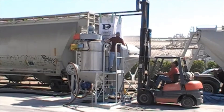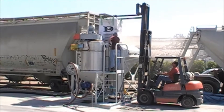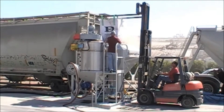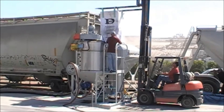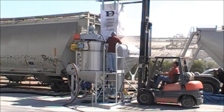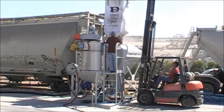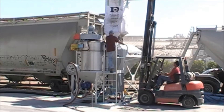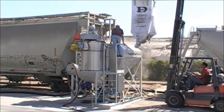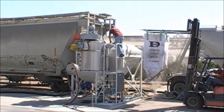The SuperSax TransPod includes a 150 cubic foot hopper with bag breaker and dust collection lines, a frame with fork pockets, 12-inch rotary airlock under the hopper, pneumatic transfer line, 3-inch air inlet with female cam lock, 4-inch outlet with male cam lock, a Wham pulsejet dust collector with fan, collection hopper with a 4-inch auger return to main hopper, cone vibrator, electrical panel with controls, and an air compressor.